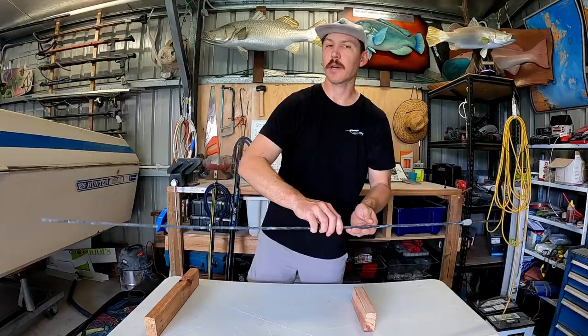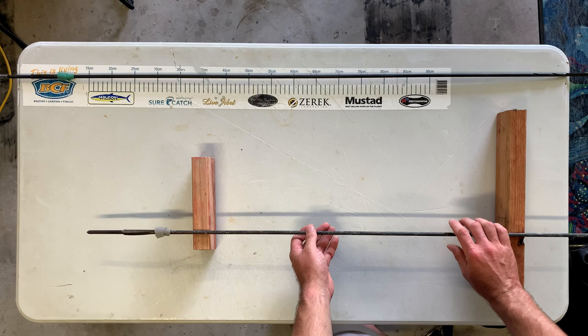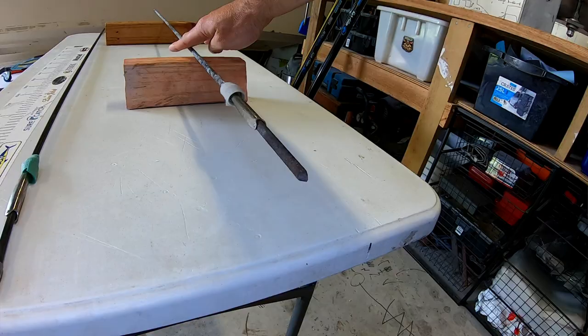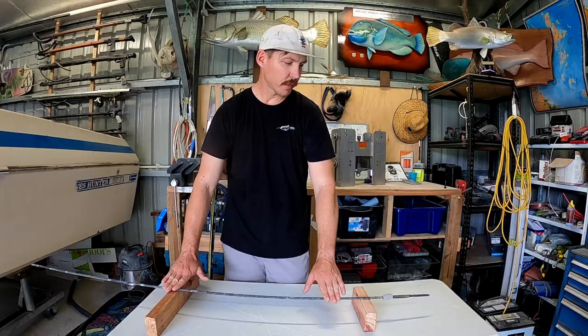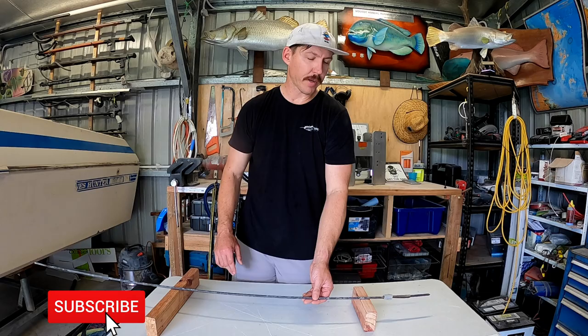But now for a bent shaft. This is a lot older shaft - I had issues with this probably about 12 months ago and just put it up on a rack, there's no point trying to straighten this one. If you watch this end here, you'll see it wobbling around as I'm rolling it. Now this one's actually bent from here up forwards. That shaft the other day was actually bent sort of mid shaft - it was very noticeable once I got back up into the boat. So thanks for watching guys - I hope you got something out of that one. If you did, please like and subscribe. I'll catch you on the next one. Cheers.